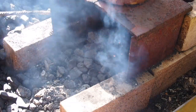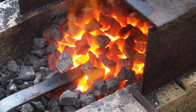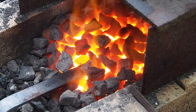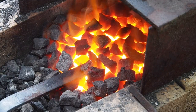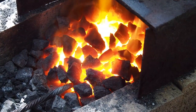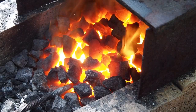Coke requires a lot of air compared to the other three fuel types. Consequently, you'll get a larger fire on average than with charcoal or a normal coal fire, where you can really make a small fire by turning the air blast low. This is not really possible with coke. Coke tends to have bigger fires, and you isolate it by simply piling coke on top of it.